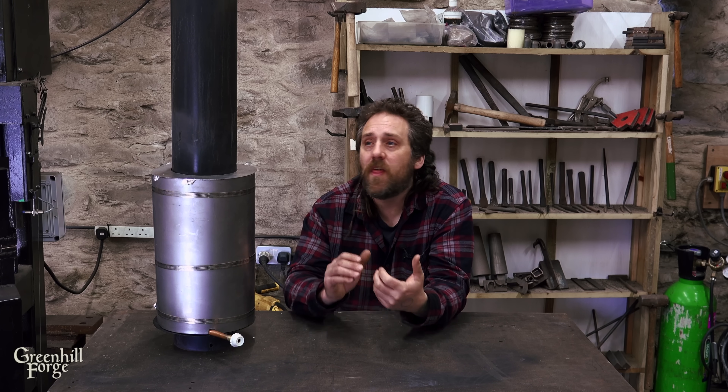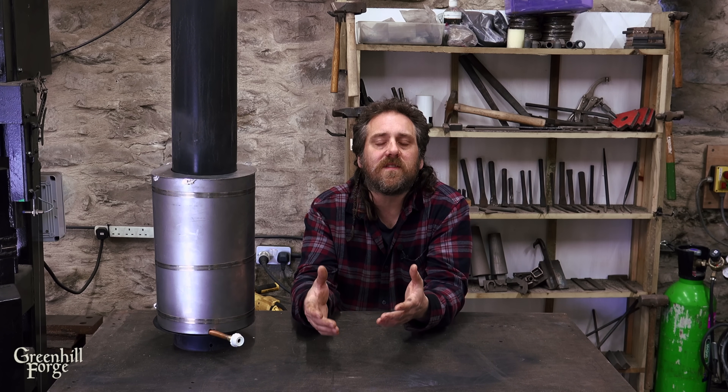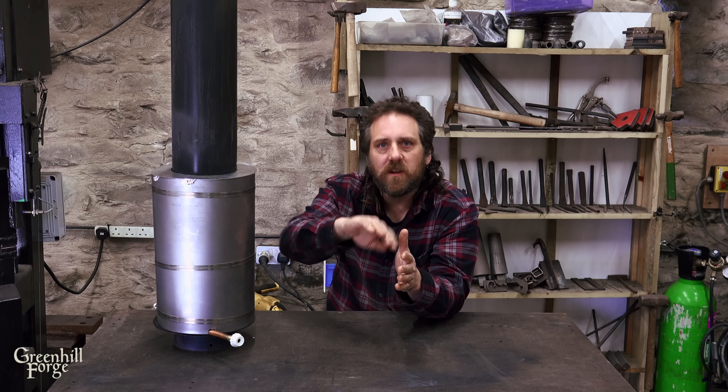After I get the first shroud on, I'll put the insulation and outer shroud back on around the whole thing. I'm not sure how this test is going to pan out, but I do think one thing working against it is that the sand itself is a thermal mass and it might take a really long time to heat up, actually stealing heat that the water would otherwise be carrying away. The water is a thermal mass and the sand is a thermal mass — they're both going to be competing to take as much heat as they can. But after a while, once the sand really comes up to temperature, it might actually start assisting because now the copper is going to be heated from all sides.